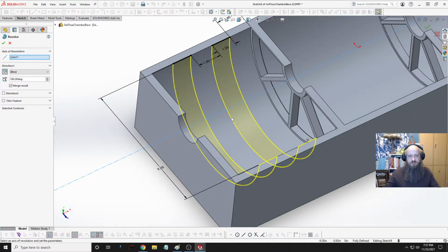and then when I put the new bearing in the stationary shaft, or the stationary hub, the shaft will rotate and there will be no wobble while it still maintains and holds tight to that surface. So basically kind of like how drum brakes work in a car. They have your drum, it's a cylinder, and then they have the brake pads, and when you press on the brake, it expands out and it provides friction to the inside of that plate, thereby slowing the car down. This is basically the same principle.